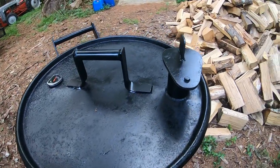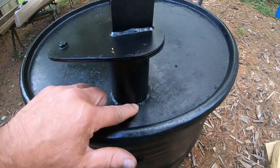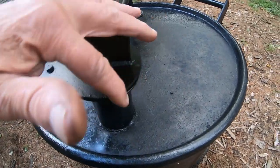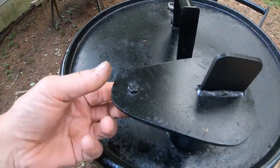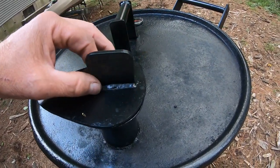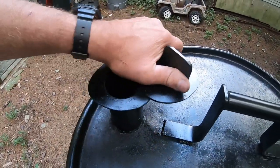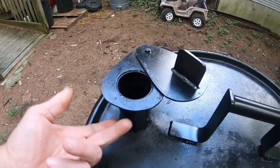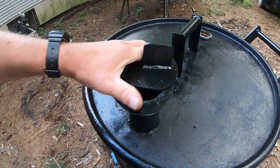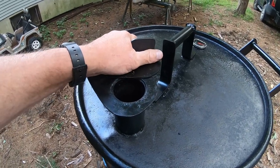Starting at the top: I've taken a piece of 2-inch pipe and welded it all the way around the top. Then I took 12-gauge metal, cut it in a teardrop shape, put a 1/4-inch bolt here, and welded a little piece of 1/4-inch steel on both sides. That is my smoke hatch, and it helps me control how much smoke I want in the drum — whether I want to close it off completely or open it up for more draft.